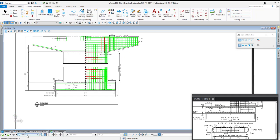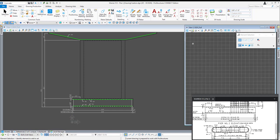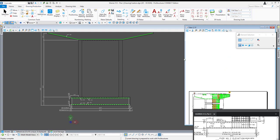Now with that completed, I'm going to go back to the elevation full drawing model. With our settings currently — no rebar being displayed and only selected re-symbolized elements showing up — I'm going to activate the section callout tool and choose my drawing seed of section full size filled, height from model, create drawing. The only thing I need to be concerned with is that where I place this is below that reference boundary. I can stop and in the second view that I have open — if you don't have a second view open, open one down here on the view toggle — click view attributes and switch my model to the sheet.